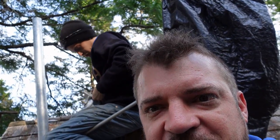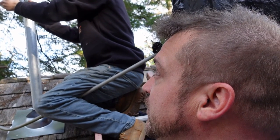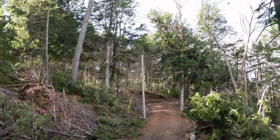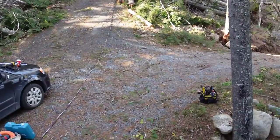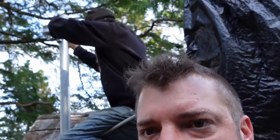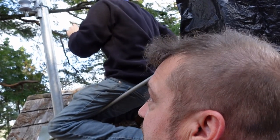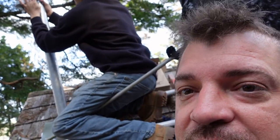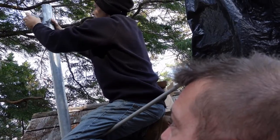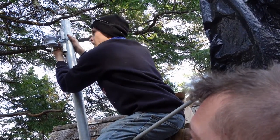The rack is going to face the service pole — that's where the triplex from the utility hooks on to give it support. He wants it about two inches from the top, facing right at that pole. You can see the whole utility line has come down on the ground from the trees — they're just letting it lay there for now. He's going to tighten the rack down with channel locks. It went on upside down — we got it flipped around, right about there.